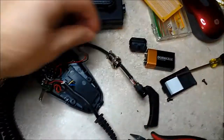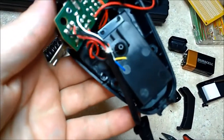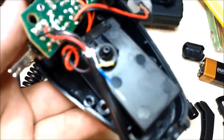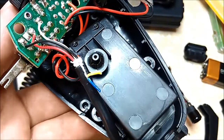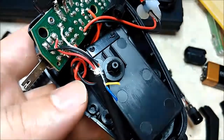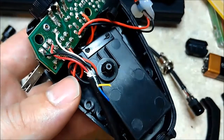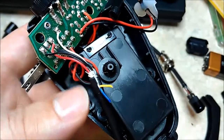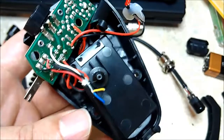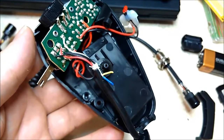When we go to the HiGear, we're actually in luck because it has two extra cables — an extra yellow and blue cable — which we can use to tie up to the battery. One of the pins on the Bearcat throws out seven volts when unkeyed and eight volts when you key in, so that should be enough to power this up without the battery.